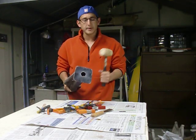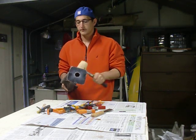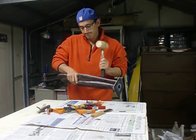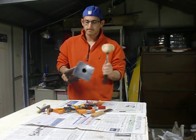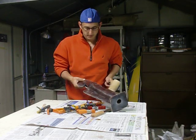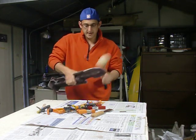When I start tapping, every once in a while you'll hear a slightly different sound, and that's the sound of the actual part releasing from the mold. This is why I make the molds nice and thick so that it can handle the stresses of this step here, but it's kind of a necessary evil.